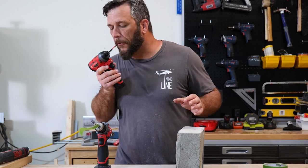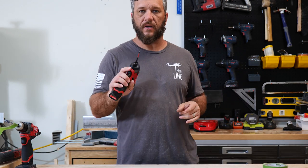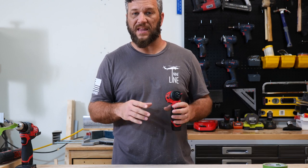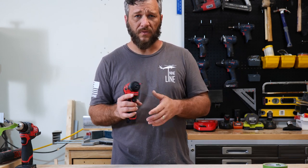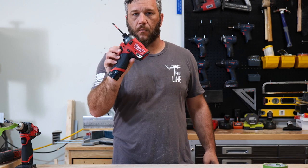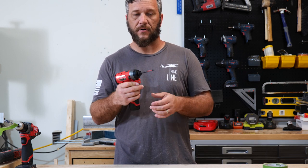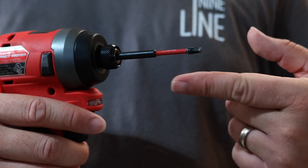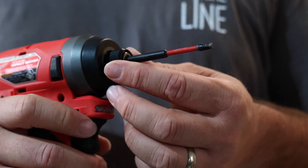What is an impact driver for? If you have a drill and a hammer drill, why do you need an impact driver? An impact driver is specifically for driving screws — generally driving a lot of screws over a long period of time, or maybe even big screws. Think of an impact wrench for car lug nuts and how big and powerful those are. This is kind of like the woodworker or handyman's version of that for screws. You can actually get adapters to make sockets work on these, which is really handy. These have a different type of chuck — a hex-shaped chuck.